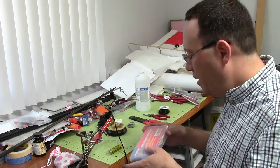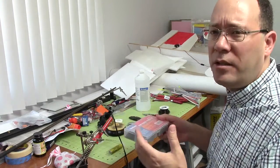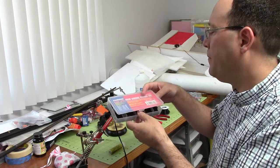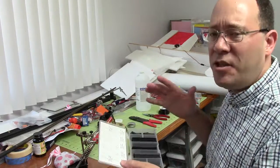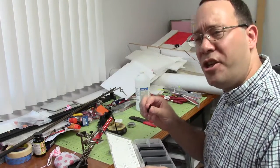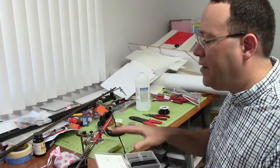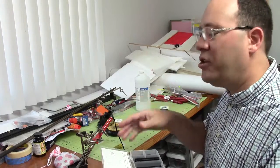The last thing you need to make sure you do a good job with the soldering is heat shrink tubing. Years ago I used to use electrical tape to cover up my joints, but now everything I do I just put heat shrink tubing on it — it's easier, it looks much better, and it's probably going to last longer. I got this assortment from Harbor Freight for like five bucks. It's nice to have an assortment because you never know exactly what size you're going to need. Be generous with the size because the connector is going to be on there too. You can use the soldering iron to shrink it, but a heat gun is much better because you're not going to leave any marks and it's going to be very even.